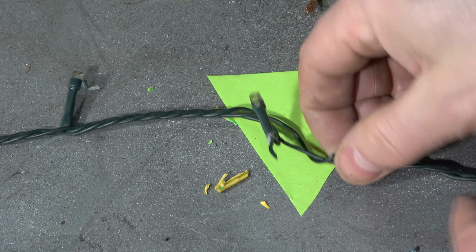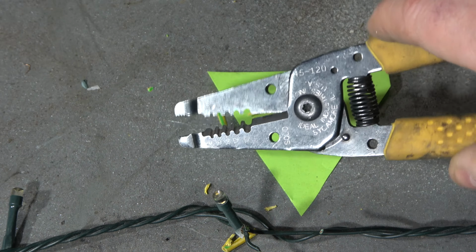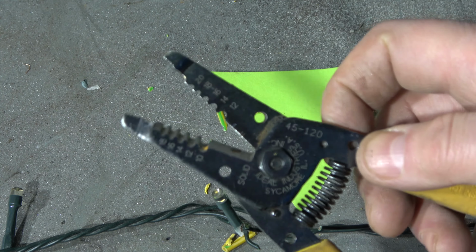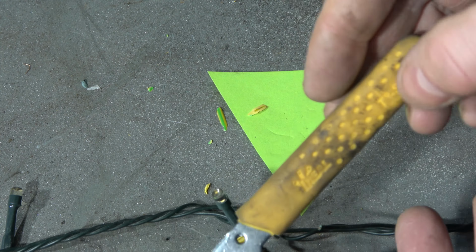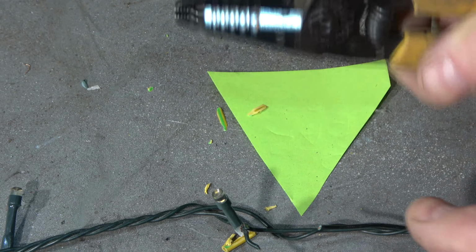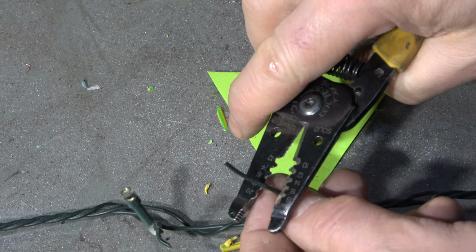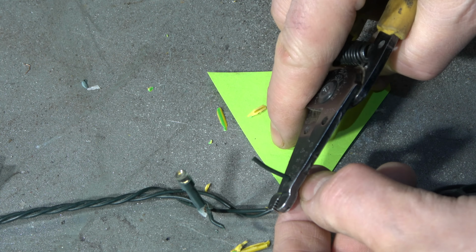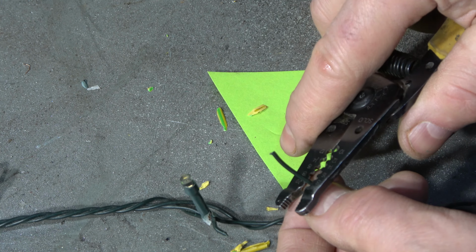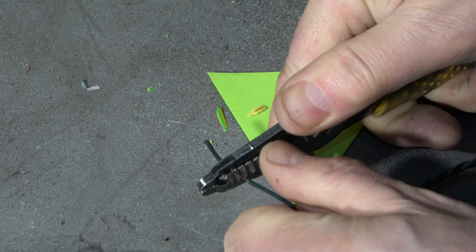This is my task. But now I have a very thin cable. And that's why we should use that kind of wire stripper. This cost about $10. And this is made even in USA, Illinois, USA. And the maker is, if I read, T-Stripper. T-Stripper is these things. And I can choose different sizes of holes. And now I have a really thin cable, so I take the smallest one. And about 1 inch or half is what I remove of this green cable. And I compress these pliers, and at the same time I pull this cable in that way. And look.